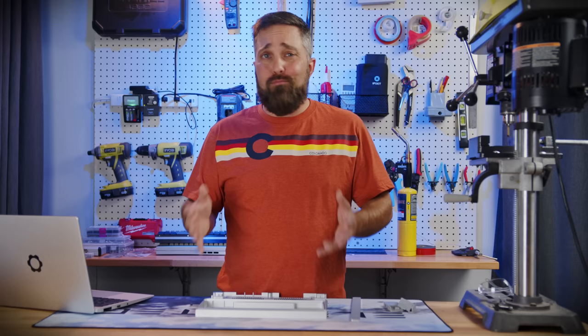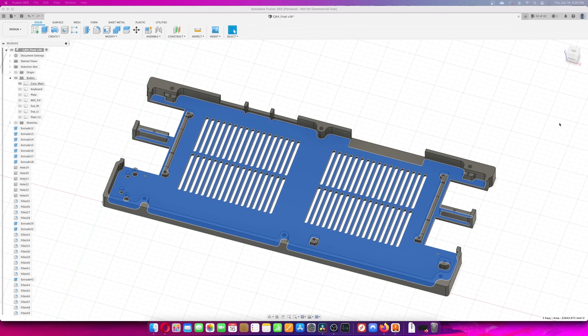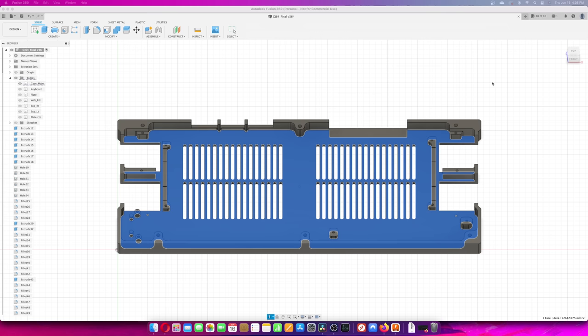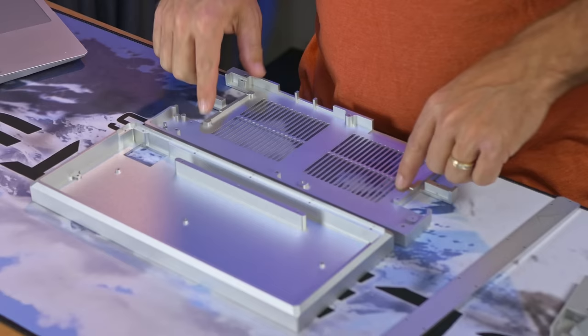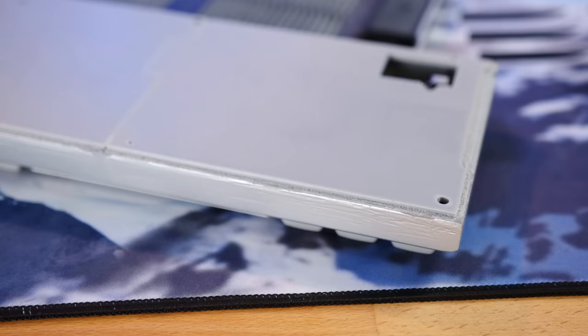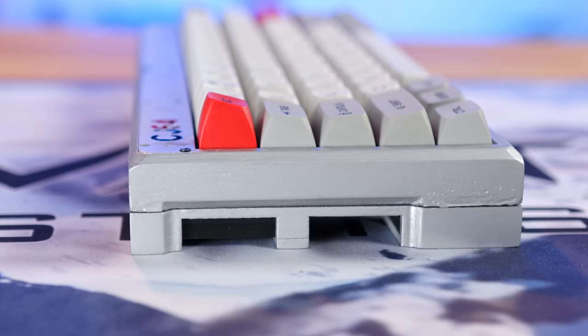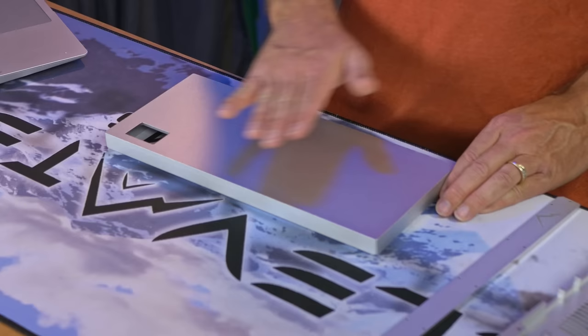Prototype manufacturing is not cheap, so almost all the changes I made from version 1.2 to this were changes to reduce the manufacturing cost as much as possible. So the first thing I did was redesign the parts so they could all be manufactured from a single side and didn't require the part to be flipped. For example, the keyboard case had a lip routed into the bottom, which allowed it to fit snugly into the mainboard case, and the edges above the expansion ports were chamfered. I completely flattened the bottom so the keyboard case could be entirely machined from a single plane.